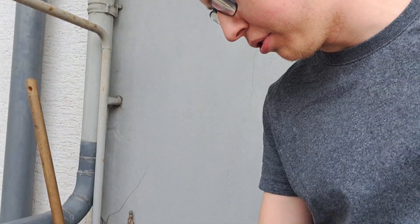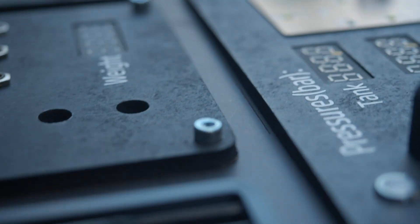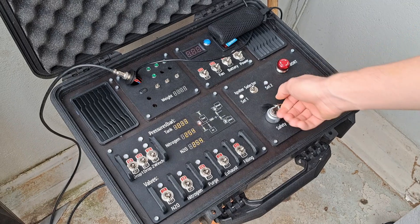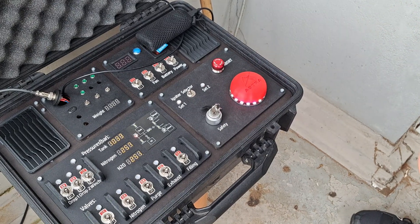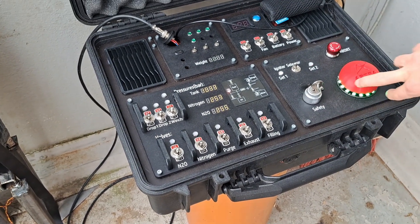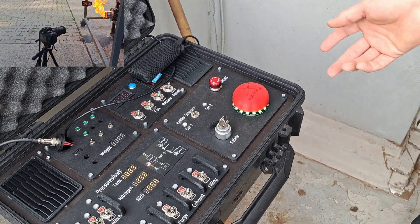Over here we have lots of switches which we can control the different valves with — one for nitrous, one for nitrogen, and many other things. You have a live view of what's currently on in the filling station. It will also be used for igniting the rocket — we can select our two different igniters, and after the safety switches are turned on the button is live, which you can see by the green light under it. As soon as that's pressed, you see the progress with white lights showing how far we are in the firing sequence — the third light turns on when the igniters fire, and again when the main valve is turned off after the hot fire is complete.